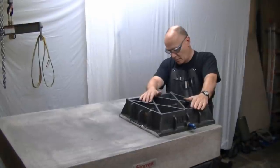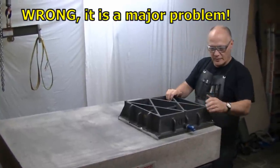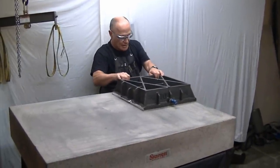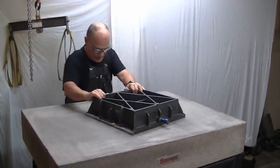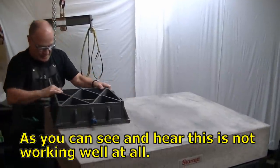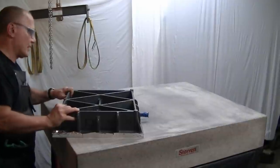I have no idea how this aluminum's going to hold up. I'm surprised that the weight of this plate isn't a huge issue here. It seems to be okay. This is a very heavy plate, like 130 pounds. So I'm taking the lap around here in a minute. All this dark you see is, I think, the aluminum actually wearing from tumbling abrasion. I'm just trying to get a feel for whether this aluminum's charging or what's going on. I know from past experience that I don't want to get too much smut going on here or it will smear and tear. I'm just feeling something right there.